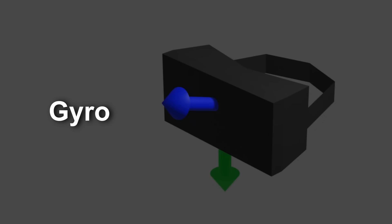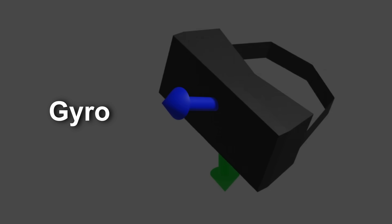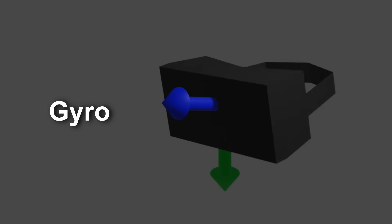To bring back the fast movements, I grabbed data from the gyro sensor, which just measures rotation at any instant. The gyro alone is not enough, though, because over time it'll drift and loses track of which direction is north or up. So the combination of sensors allows them to compensate for each other's weaknesses, giving you a much more accurate head tracking.